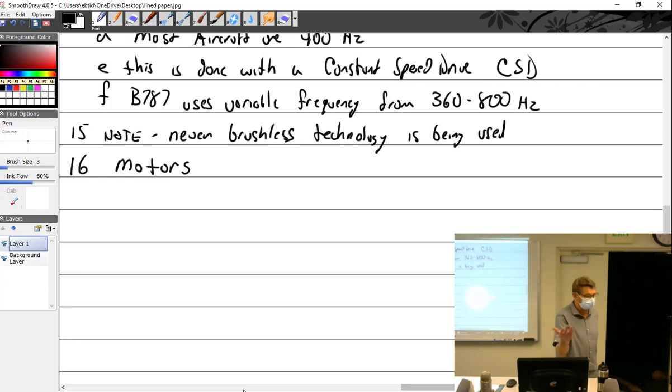For example, you know better if somebody's looking at amperage and goes, whoa, dang, there's a problem. Every time we start it up, it draws way more amps than it should, and then it kind of comes down. So, well, I guess we got some bad brushes. You're like, wait a minute, no, it's supposed to do that. That's how they work. But you'll find people like that out there, so you'll know better.